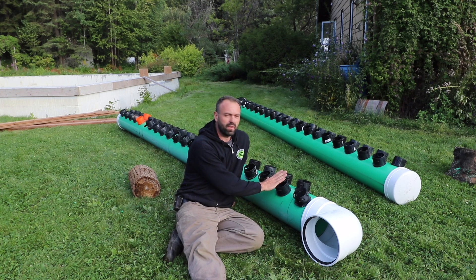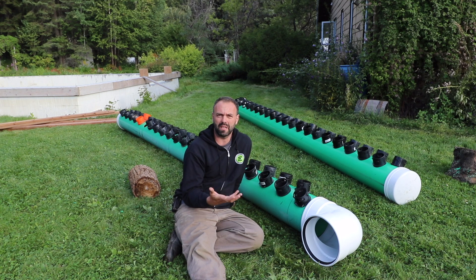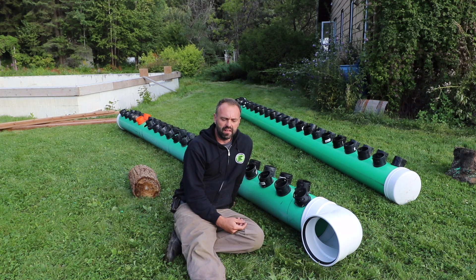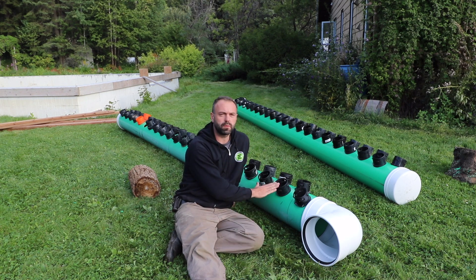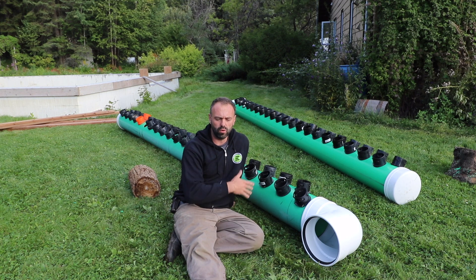The other benefit of having the perforated pipes is that the moisture that comes out of the air can actually feed the roots of the plants. In the same way that we get energy coming out of the air through condensation in the summertime, we can actually get cooling through evaporation. When warm dry air goes through this system and creates evaporation in the soil, it has a cooling effect. That's why they call these subterranean heating and cooling systems — they actually act as a dehumidification and rehumidification system to cool or heat the greenhouse depending on what's needed.